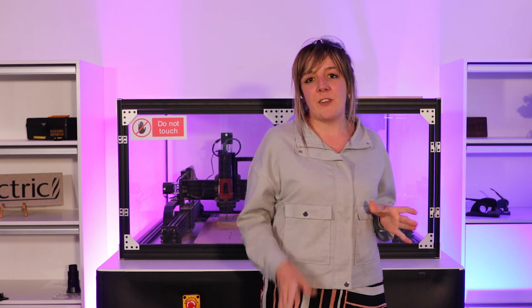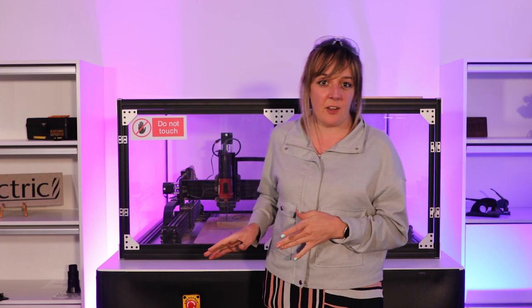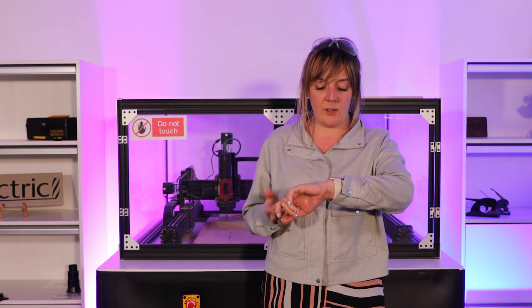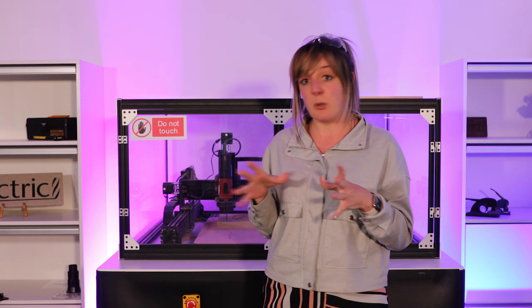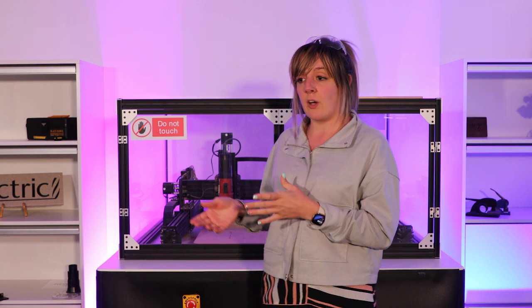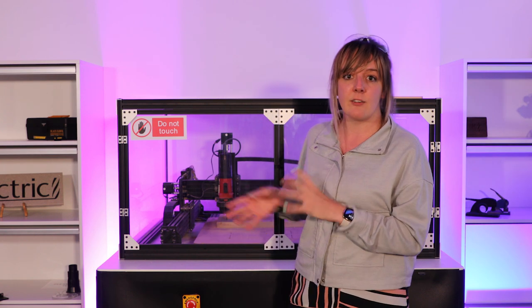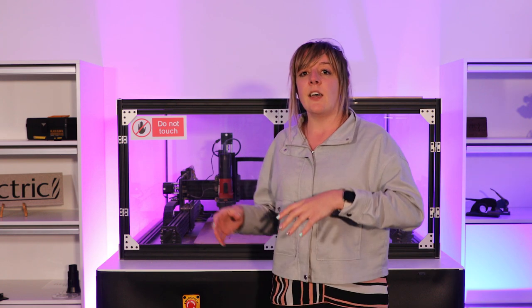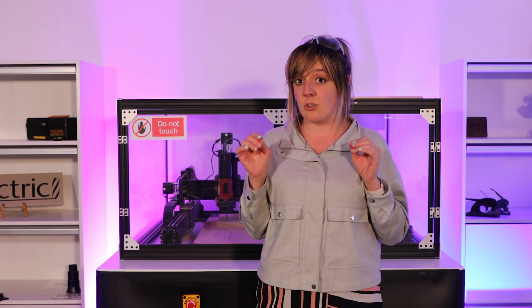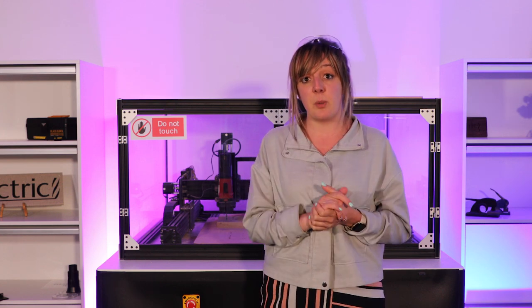Okay then, so we've finished machining the top side of our trinket bowl. So we're actually gonna call it a night right now, and the beauty of the setup that we've got in this file is that tomorrow we can reset our X0, Y0 on the machine and then machine the bottom set of dowel holes into the spoil board, and that's going to give us perfect alignment.